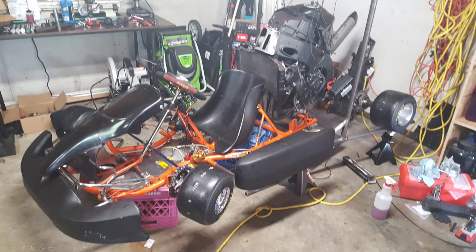It looks like I've actually bolted the seat through. To do this I sat in it, supporting the bottom of the seat with a crate, tried to center up as best as possible, holding it and marking it with a punch going through the frame through-hole and marking the plastic seat. I drilled through and bolted it together. On the other side I did the same thing. To get the height correct you put a spacer between the frame and the seat, and you drill where it should be so this can pivot up until you get where you want it — then you drill your holes, put your spacer in, put the bolt through, and you have the correct height and angle for the seat.